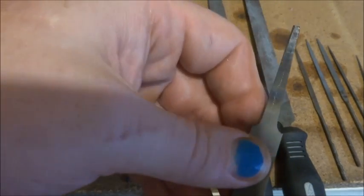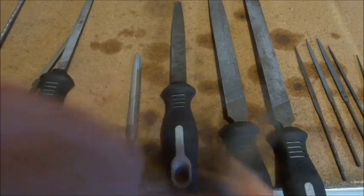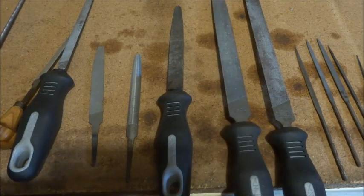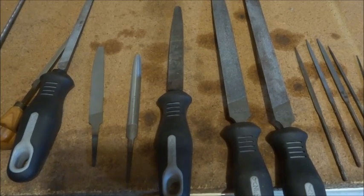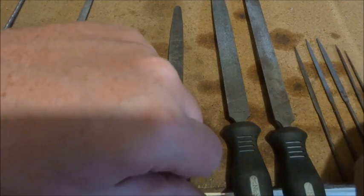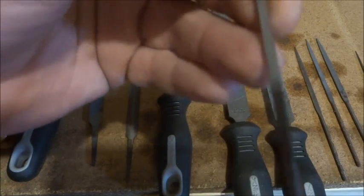Files come in different lengths. Engineering files are measured by their effective cutting length — this is a four inch, this one is a six inch, and this one is an eight inch. You can sometimes find a square file, and they're well worth having in bigger sizes. It's handy if you can get two of them — touch one on a stone and make a safety edge on three sides, and it makes a fairly useful file. If you get an old one with still a bit of cut in it, it's handy to modify them.